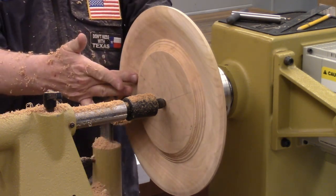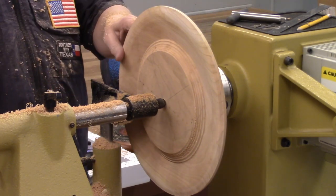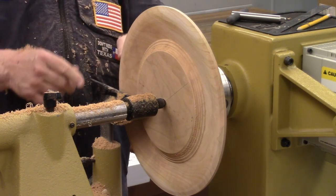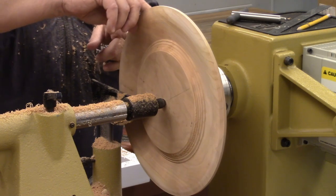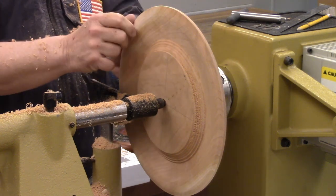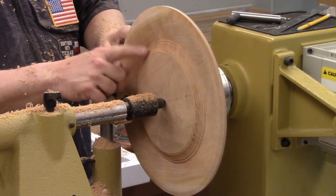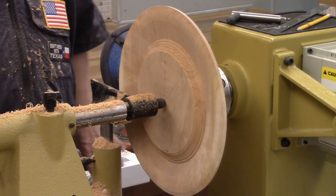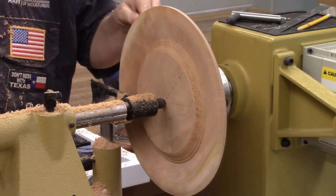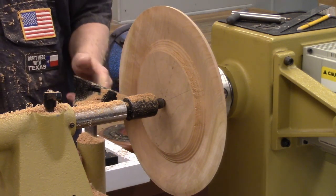See that we've got a surface that's going down, and after we get it colored, I will show you how I approach and create that edge, which is just 10 seconds with a parting tool, and then we go from there. Normally I've got these very sharp edges and I hate those, but that's dealt with by 120 sandpaper going like this, and it's the safest, and you won't chip it or anything else. I didn't bring sandpaper, and with all the food here, you probably appreciate that. Any questions? Okay, so I've got just a little bit of curve cleanup over here before we go.